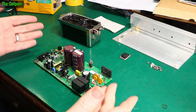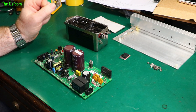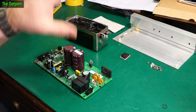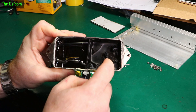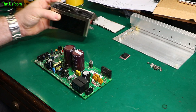I was thinking the drive controller may also be a problem, because sometimes a failure like this is triggered by something else failing first — like a big surge. With the description of the belt moving by itself when she turned it on, that might mean a multiple fault situation. I thought I'd better check this board. On the other side, this is what the actual filter looks like inside — it's all potted, not much to see, but you can see one of the big inductors. One side is a rubbery kind of material, the other is epoxy — I don't know why they used different materials on each side. Nothing to fix, so I've ordered something similar.